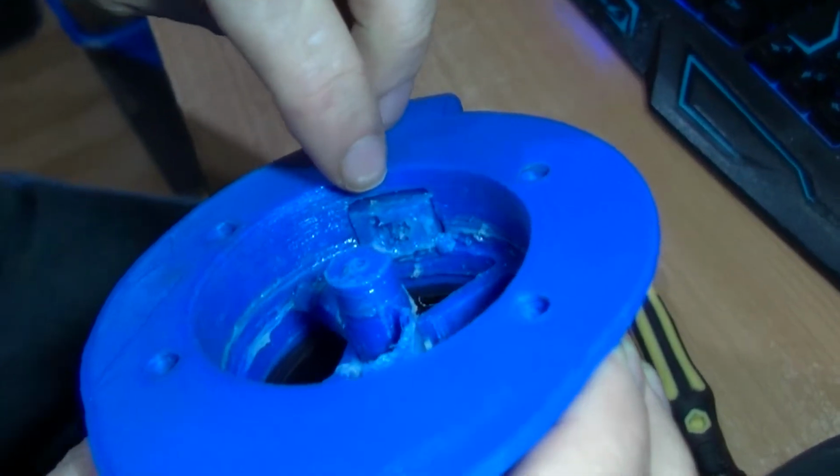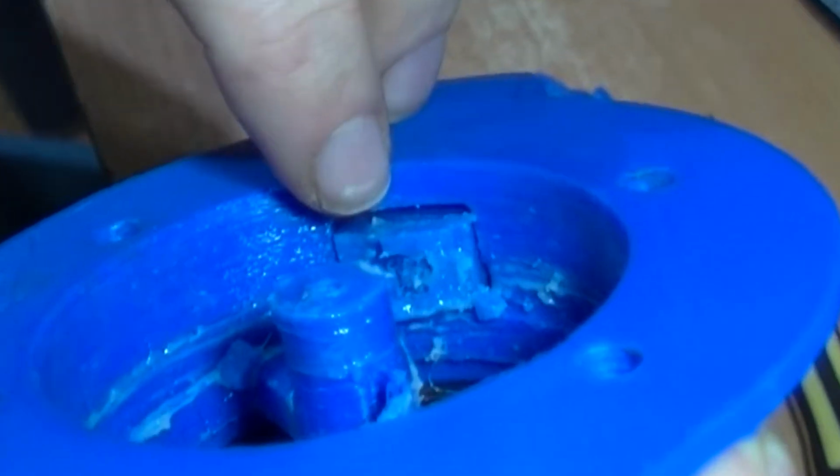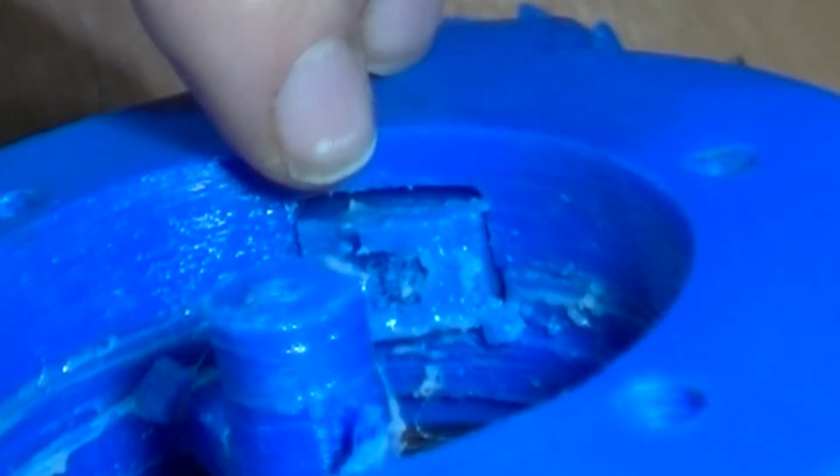it's supposed to have a point on that. I think when I printed this out, I've done it with infill on 30%, and I probably should have printed it 100%. Yes, you can see that. Probably see some of the infill there below the grease. Just in here, looks like infill.